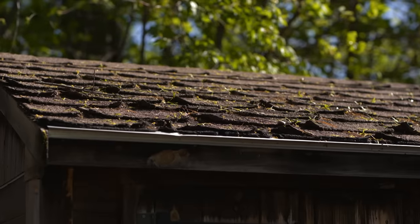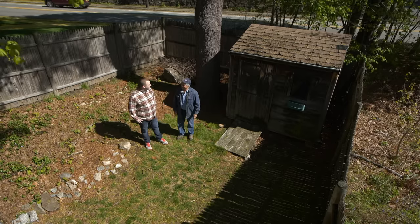There are signs I look for when I drive by a house: first I ask for the age of the house, then I look for granules missing on the shingles, any shingles missing, and cupping — that's definitely a sign you need a roof. The interesting thing about doing a roof on a shed like this is it's the exact same steps as doing a roof on your house. All the process, all the elements are the same. So if you learn how to do it on this, it'll be the same process for your house.